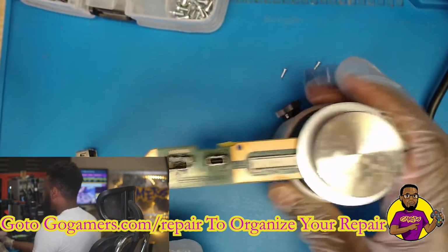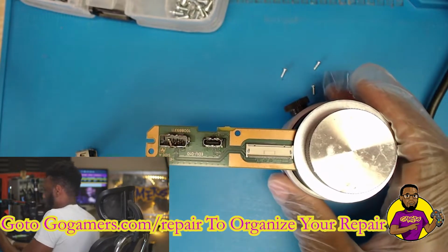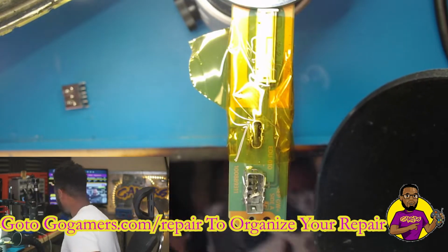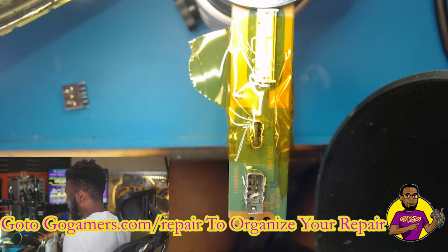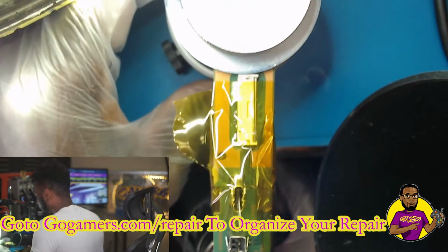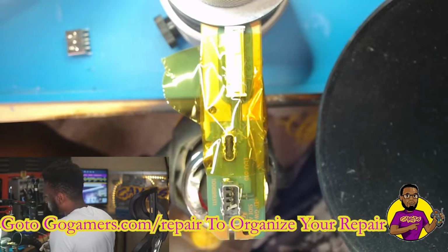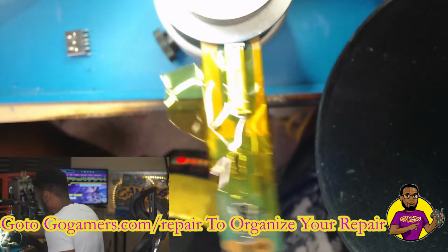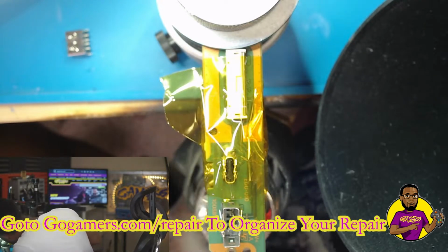So let's go ahead and now attack this and get this taken off of the board. Here's how we're going to do this. All right, guys, let's get started. Turn on fume extraction now. Got my heat gun up and running. We're going to do that same technique. We're going to put this a little bit further over the edge. I wrapped it in Kapton tape, as you can see, and this will give you a clear view. This is why I didn't want to go under the microscope this go around, because this gives you a clear view on exactly how I'm able to heat it up quickly from underneath the board.